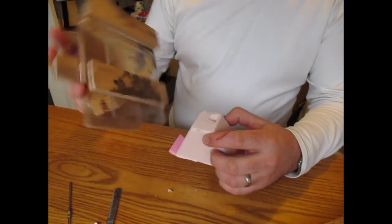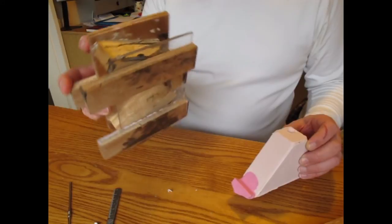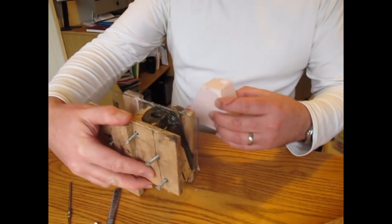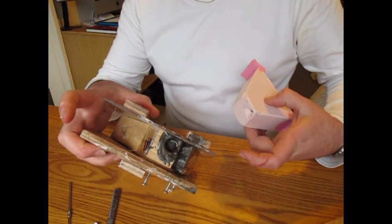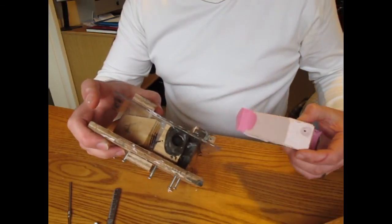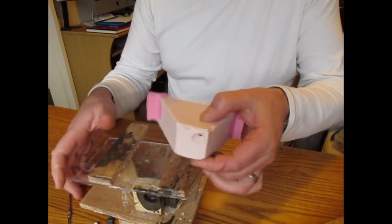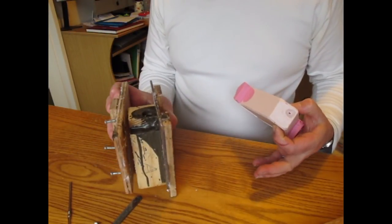So this will be the housing, which I poured that way up to get the mould. Now when we're going to turn it over with this inside and the tooth, you can see I've got to re-drill this hole in the bottom. That's the entry port for my resin. So I've got to position the tooth inside this, put this inside that. That's what these legs are, because it's going to stand inverted while I pour the resin.